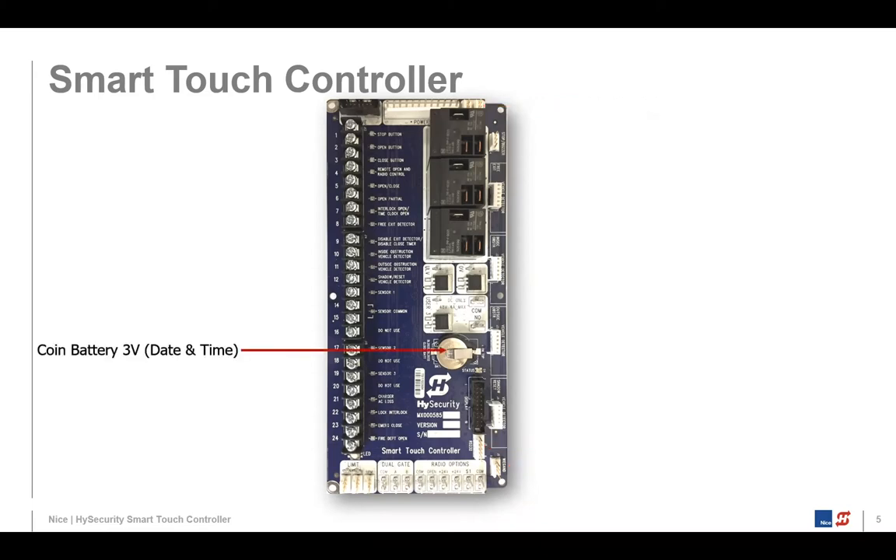We also have a coin battery — your standard 3V CR2032. The whole purpose of that coin battery is to keep the date and time accurate. On board the Smart Touch Controller, we have what we call non-volatile RAM, which means that when we turn off the machine and there's no power, the contents of non-volatile RAM will still be there. We create 320 entries in that, which is what we call the event or history log — really handy when you're troubleshooting. The coin battery lasts three to five years; if it goes out, you'd get an alert 17 on the display saying 'bad coin battery.' All other functions of the operator would function normally — it's really there just to support that date and calendar function.